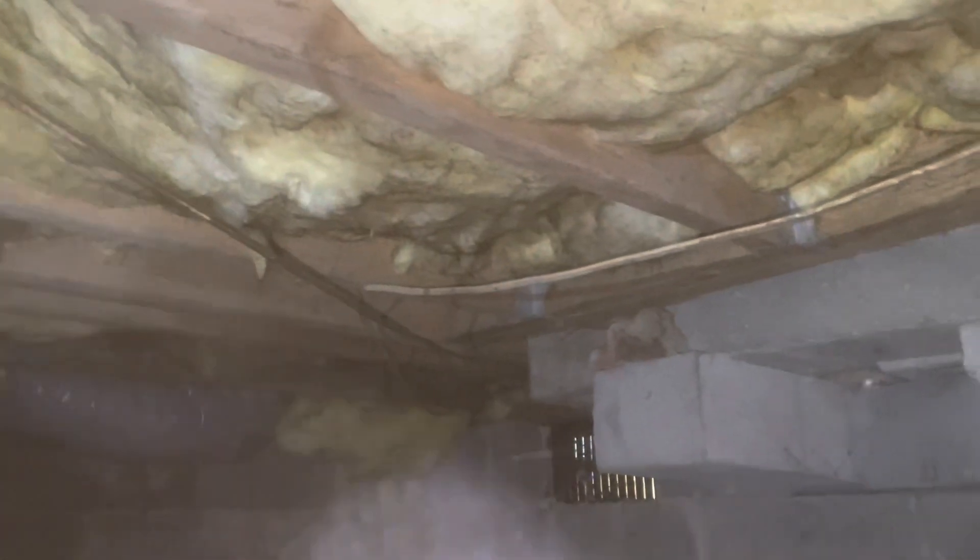Insulation is missing, there's discoloration on the floor joist, and this room kind of smells a little musty. Some of the block work at the fireplace seems to be coming down — there's a spot there and another spot over here. You'd think they would have something underneath supporting it, but it's just cantilevered with lintels into the foundation. The hollow-core cinder blocks are laid on top without being mortared together and they're breaking at the seams.